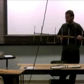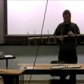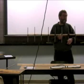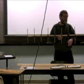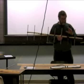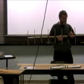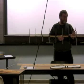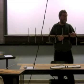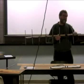So, what about gain, and what about directivity of an antenna like this? Basically, if you've got the single driven element, that's a reference dipole. That's got a little bit more gain than an isotropic source, which is just a theoretical concept. So using the dipole as a reference point, if we put one element here, a reflector, that has the effect of giving us about 3 dB gain, which is effectively increasing the signal level by a factor of 2. And it makes the directivity of this about 90 degrees.